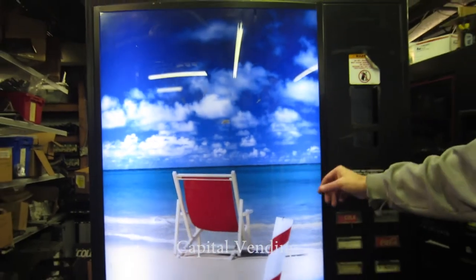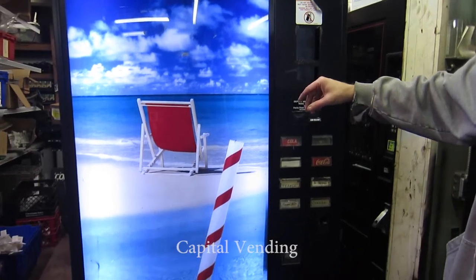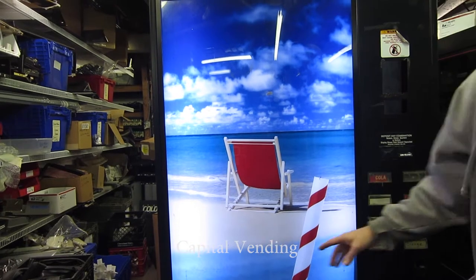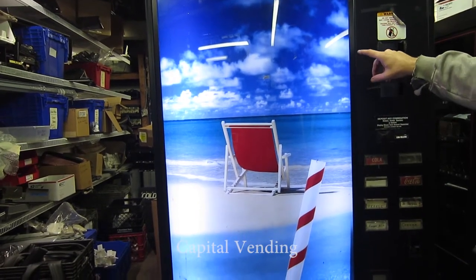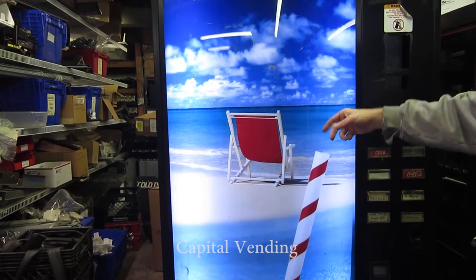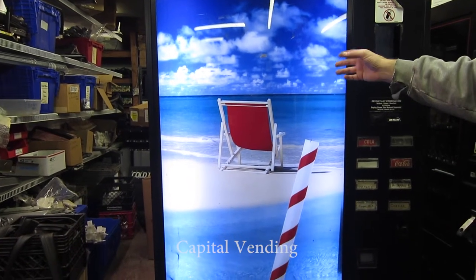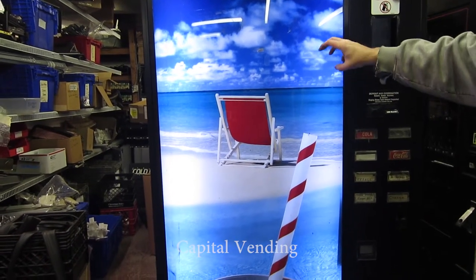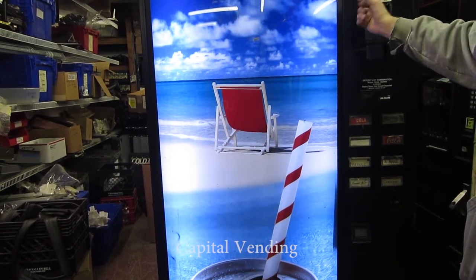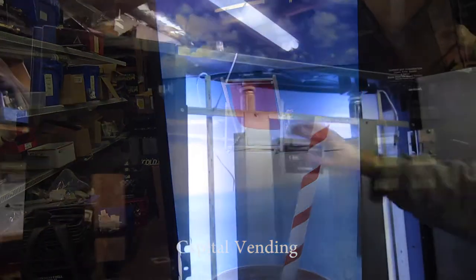Here is a picture of our sign face — everything is fully illuminated. In the event that you do get a long shadow right here, like it would look like a bar, that would have to do with the spacing of the LED strip. That shadow is being created because the existing fluorescent light bulb is still in place. You can leave the fluorescent light bulb in there because it will never come on, since you've disconnected the power. But if you do get the shadow, you can take out the fluorescent light bulb, or I'll show you how to space out the LED strips to avoid that shadow.